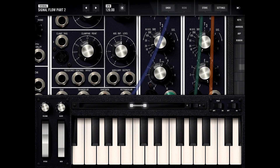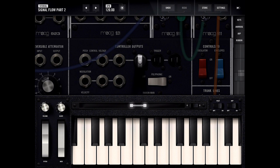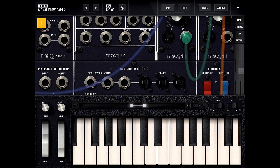And you have two of them. This trigger input we saw before with the controller output — by default it's wired like this. You'd have to turn off Envelope 1 right here with that blue switch. So if you turn off the blue switch and you don't wire it, then nothing happens because the trigger doesn't occur.